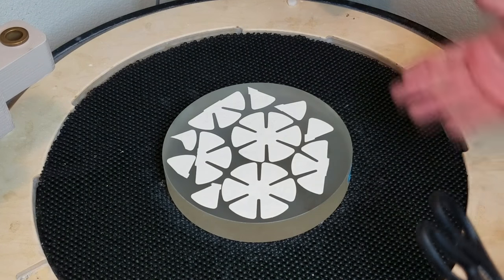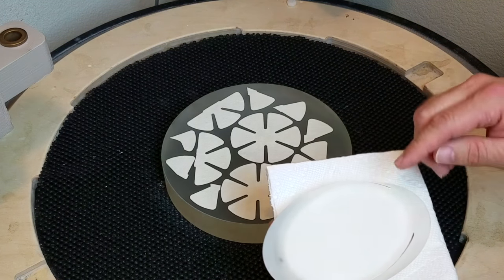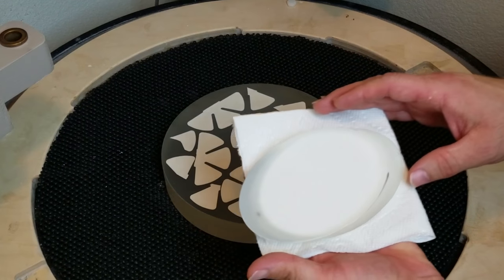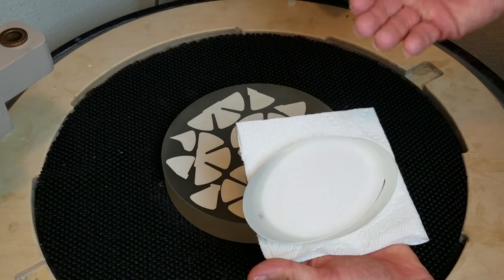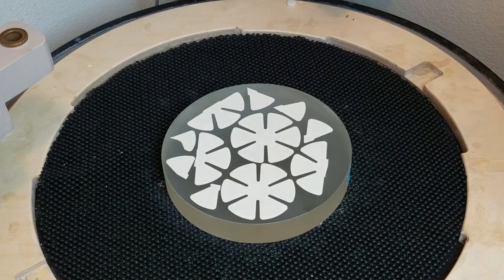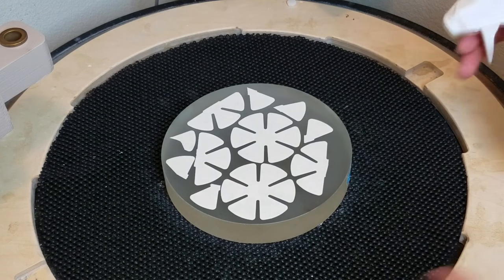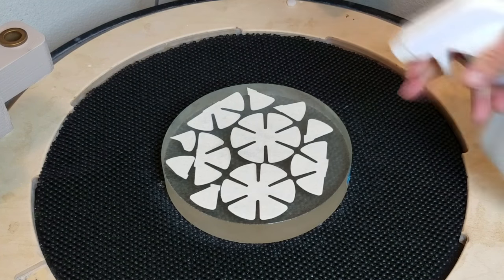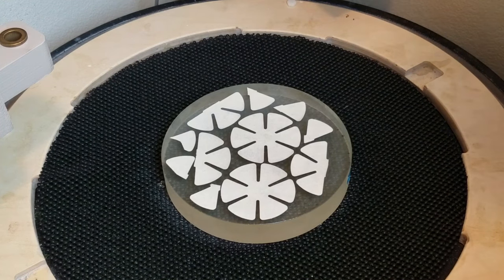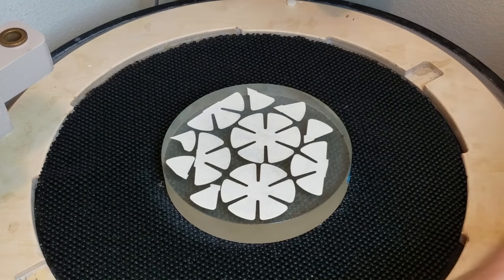The first secondary mirror I'm going to work on is this three-and-a-half inch — I'm polishing the back side so we can see through it to run the interference test. Before we begin, we have to get the surface charged up. With polishing pads, you run them quite wet and don't use much cerium oxide — after you charge it up, it only needs to be recharged occasionally, not nearly as often as a pitch lap. I just wet the whole thing down.